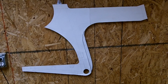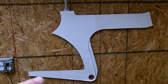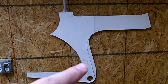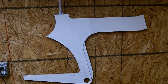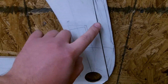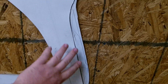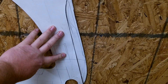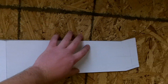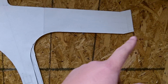Hopefully that will increase our aerodynamics, but it causes a couple of problems. First off, we needed to make the chain stay a lot thicker, and that's why you can see it's white there. We'll also add a lot of layers of carbon fiber. That causes stress here, and you'll notice there's an added-on piece. I had it all drawn on paper and it looked fine, but once I cut it out, I realized that right here was just way too thin. So I've cut another piece and added it to make it a little bit wider there, which will make it a little bit stiffer and allow me to not have to use quite as much carbon fiber in this area. Also, the top tube — you'll notice it's pretty wide — and that is also to help compensate for no down tube here.